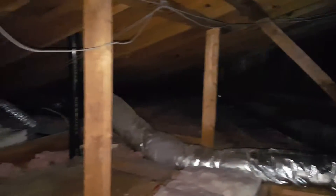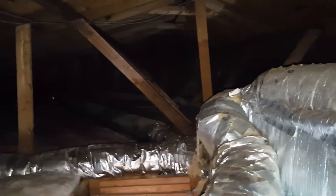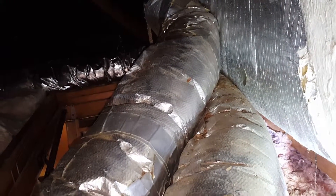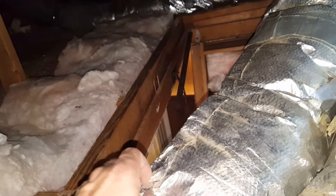This is your typical attic installation with a flexible duct system and a metal plenum box — pretty much a spider system. There's no reducing trunk line or anything like that. It's a very cheaply done duct system. I wanted to show you the type of flex it is — basically a manufactured flexible duct system wrapped in a silver backing.